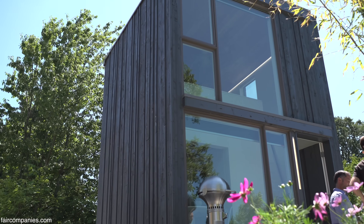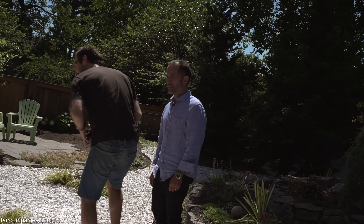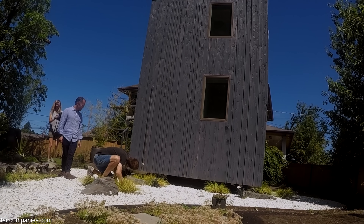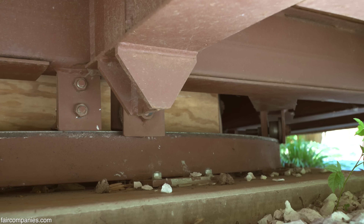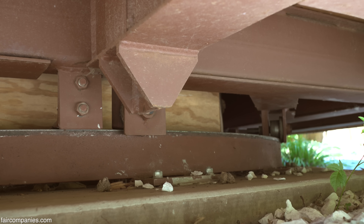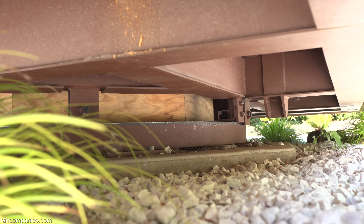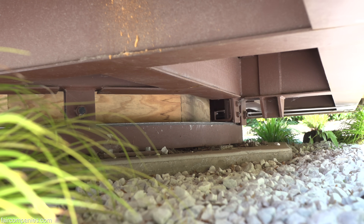What kind of mechanism do you have? It's just a really simple steel bezel with some casters on it and some ball bearings in the casters. Super simple, really rudimentary steel — just a bottom rail and a top rail. That foundation is pretty deep, probably three and a half feet of concrete for the wind load so it doesn't tip over. That's the weight for the base for wind and seismic for earthquakes. But the bezel itself is super simple.